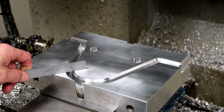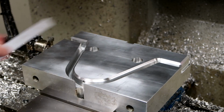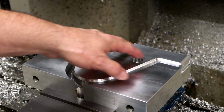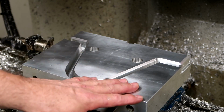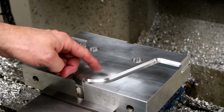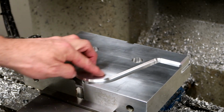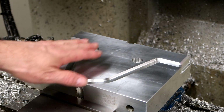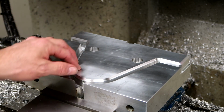So now the next thing to do is to take the vise off the table, clean all this mess up, and get the part mounted face down to the table with these two screws. Then we can cut these two chunks off of the OD to get rid of them, finish the outside profile around here, rough in these bores, and bore the first side for the bearing. That'll be the next step, and then we'll flip it over and bore the other side for the bearings.